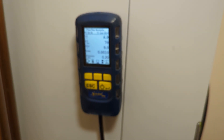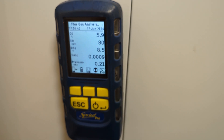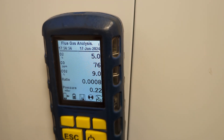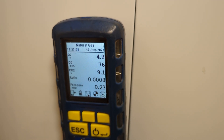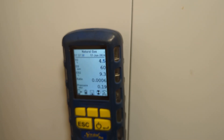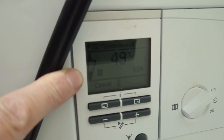After this section of video was taken, Vaillant came out that week and changed the CO sensor — this was the third CO sensor since the boiler was new, on a three-year-old, extremely expensive boiler. This is the correct reading now that I'm measuring the emissions correctly — it's showing S04 on screen, which is correct. Although the flame picture still isn't on minimum, that's probably why Vaillant changed the CO sensor again, because there's definitely an issue with the boiler. It wasn't me. For the video it says minimum, but the indicator shows it's not quite at minimum.